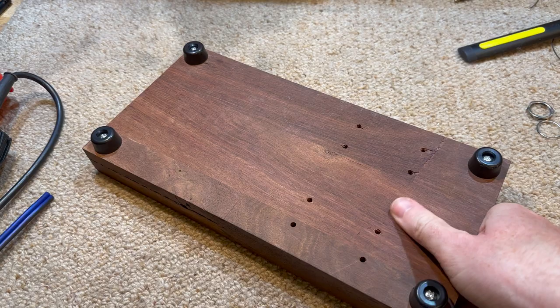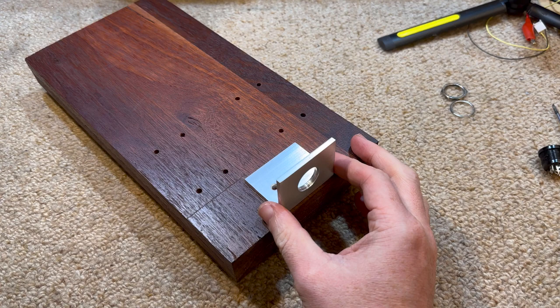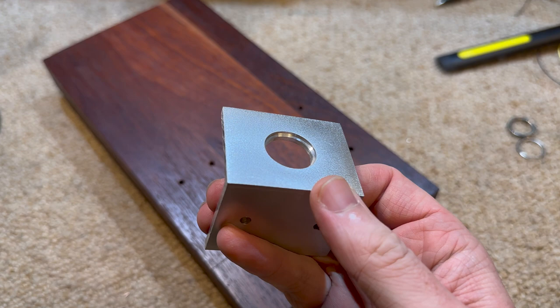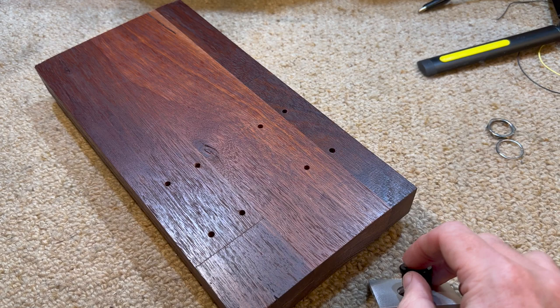So that's all good. We've got the front plate, which is going to sort of just sit there. Tried to keep it as close to the transformers as possible to minimize how much wiring we've got running across. Ended up using a step drill for this because I'm cheap and I didn't want to go and buy a new hole saw, but it actually turned out to do a really nice finish with this connector, even though I'm not sure these are going to be the final ones we use.